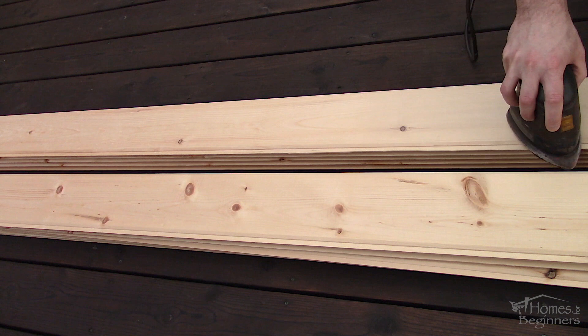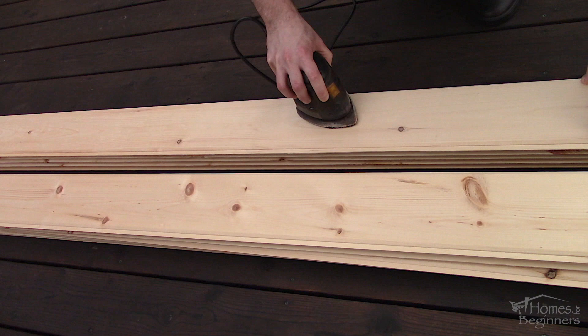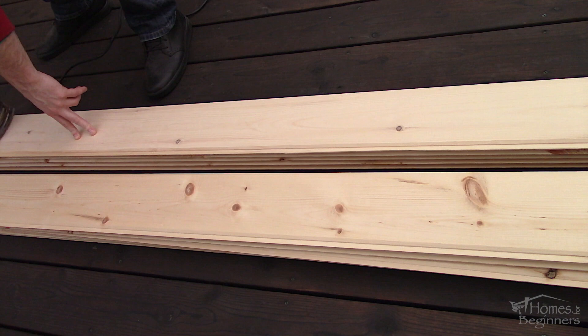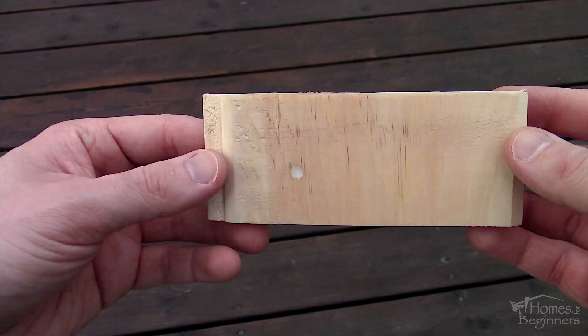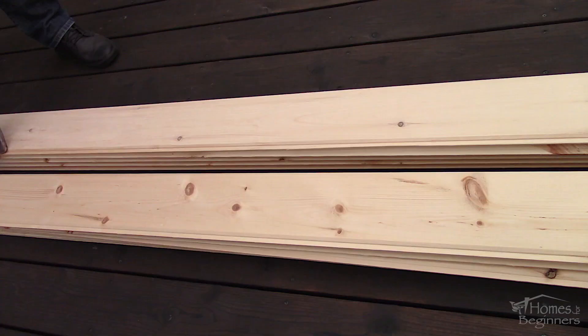If you apply more glue, let it dry again. If not, then you can move on to sanding. A palm sander is used with 180 grit sandpaper to clean up any rough spots. Go with the grain, not against it, and only use light to medium pressure. For the spots of glue, you must make sure that glue residue has been removed completely from the surface and only left in the imperfection spots. If it's not removed properly, the glue will prevent the paint from soaking into the wood and you'll be left with a visible outline. The chamfered edges were also sanded.